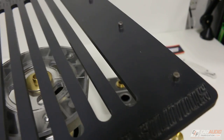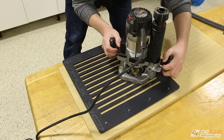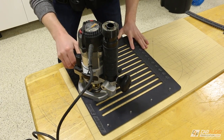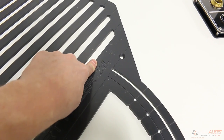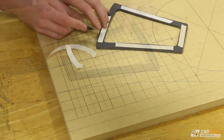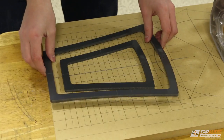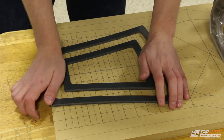This bushing perfectly fits within these slots on the Smart Ruler. This means if I wanted to make several straight cuts in the piece of wood, I can do so by running the router back and forth. What I am going to use the template guide system for right now is cutting the outside edge of this piece. I start with sticking the template I'm going to use in position using template tape. To help support the router on each side of the cut, I'm also putting this larger template on there — but you could also use straight sticks of wood.